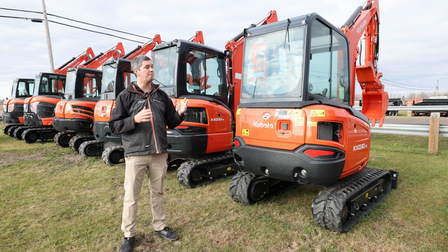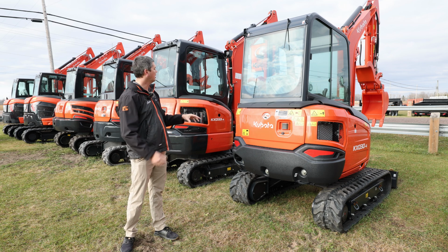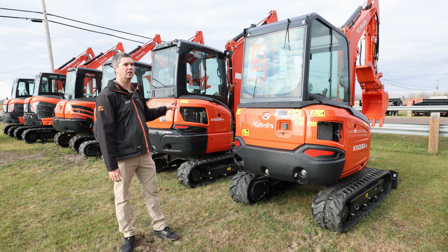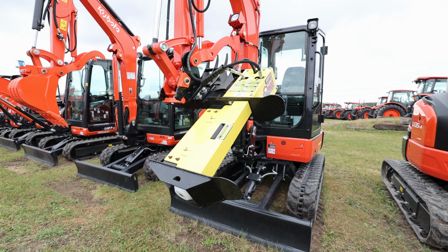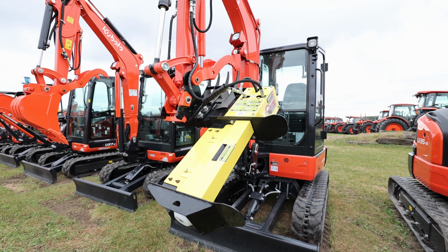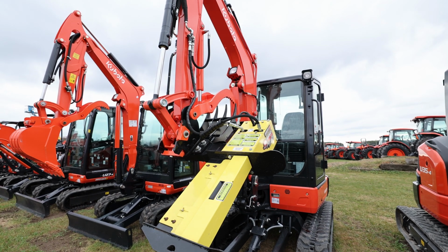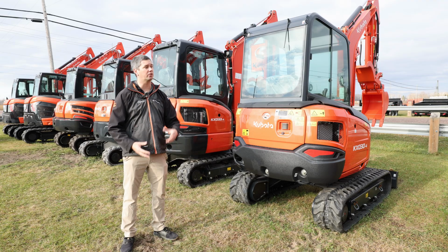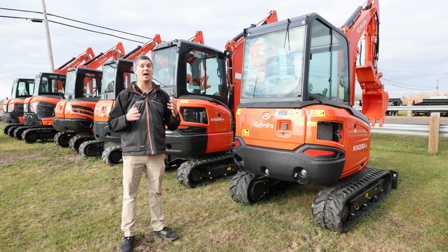So just be mindful of that whenever you're getting up into these bigger ones, what you're going to need. Again, you're up to a 7-ton float to really move these legally and to keep everything safe and sound. So whenever you get up to the 7-ton capacity on that trailer, you're going to need a full-size truck, maybe even a 3/4 ton. So think about all that whenever you're thinking about excavators, because they sit small, but they do add up in weight.